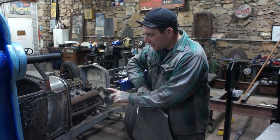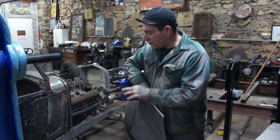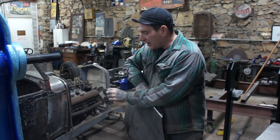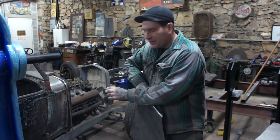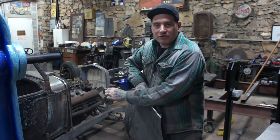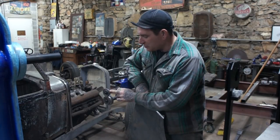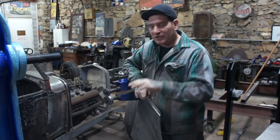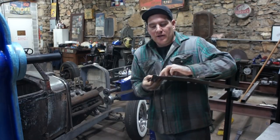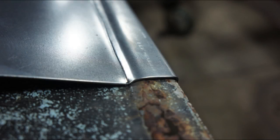Now the top die that I'm using is a tipping die that I've already made for some other stuff. It works really well. It's just a thin little piece, maybe eighth inch thin, with the corners rounded so that there's no sharp edges. And what I'm doing is spacing it. I made a couple spacers. I had to play with those to get the radius right for the step, and I got it pretty good in this piece here. We'll get some photos. And put two little spacers here.